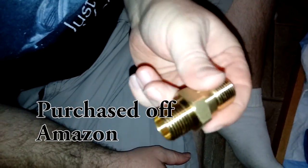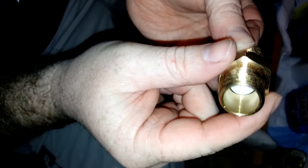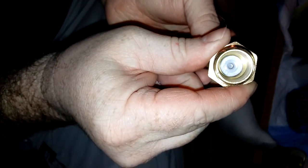I just got a new check valve — I got two new ones just in case the other one fails — and so you can easily see how they work. There's the front, and you'll notice that plunger moves forward. That plunger is right back here, so this sits in the hot water heater and the water flows that way. When you turn the faucet on for hot water, this plunger opens up and lets water flow out that way. Once you turn the hot water off, the spring pushes that plunger back so that water can't flow backwards — it can only flow forwards. That way you don't get hot water leaking into your plumbing.